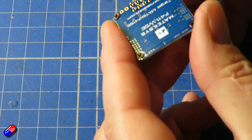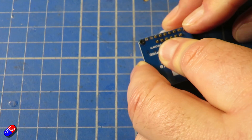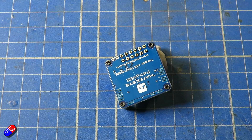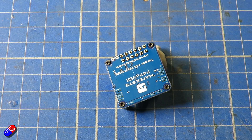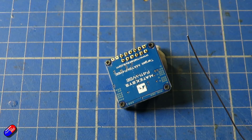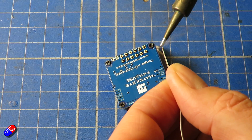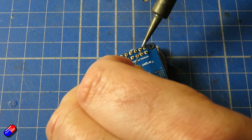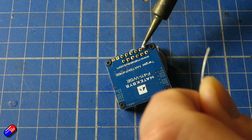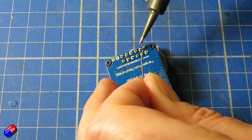If the pins don't stay in place, I use blue tack - that's what it's called here in the UK, the stuff you use to put posters on walls temporarily. Now I'm using the very fine soldering tip, which is up to temperature. You can see it has a gold color - I'm going to wipe it on the damp sponge. With the tip wiped on the damp sponge you can see how it's nice and silver. Then we're going to put the very smallest blob - I'm trying to do this off to the side of the camera. Put a little bit of heat into the joint first, feed in a little bit of solder, watch it heat and wick into the joint, and then remove the soldering iron. Get a quick wipe on the sponge so it's nice and clean again, and repeat the process.